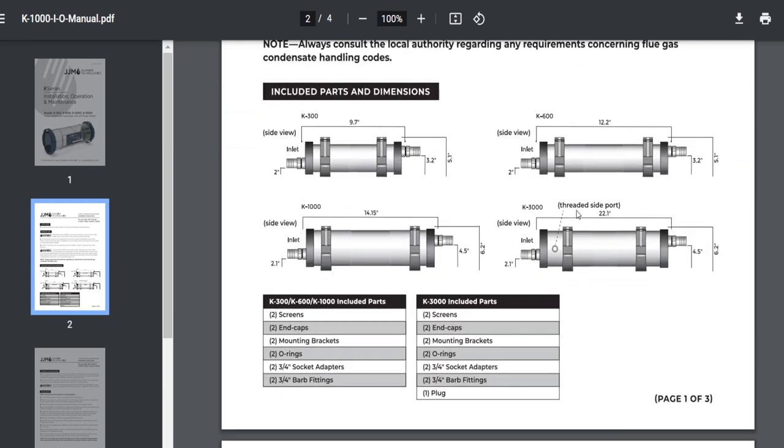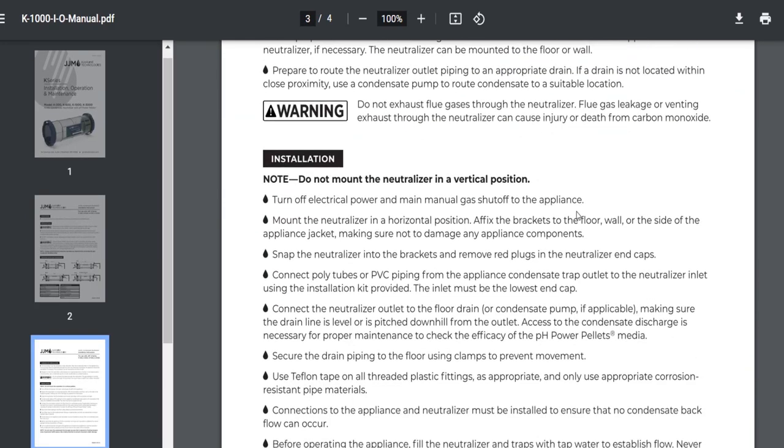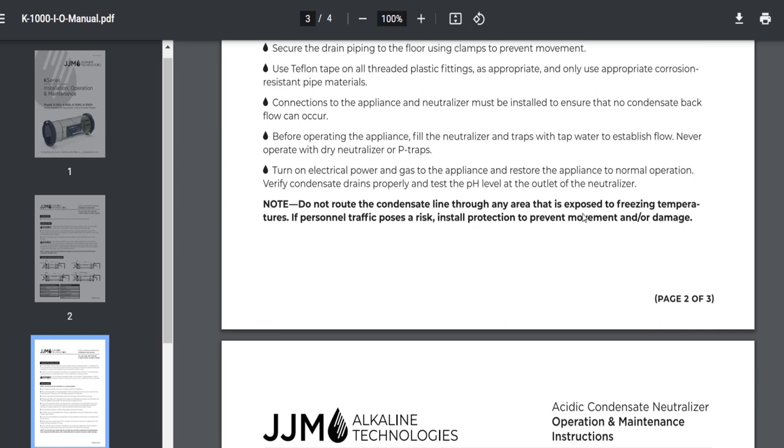I made just a picture of what they look like. It's kind of like a cylinder with tubes on either end. It's supposed to keep it so it won't rot out your floor. If you have a metal floor grate in a condensing gas furnace, the acids in the condensate will eat up some of the stuff and it's bad for the environment. So this thing is there to neutralize that — since it's an acid, it's probably got little things inside that are bases to neutralize the acid.